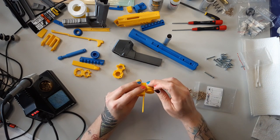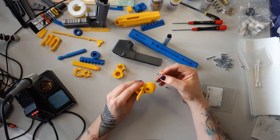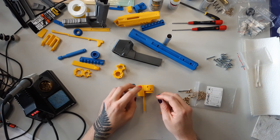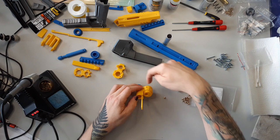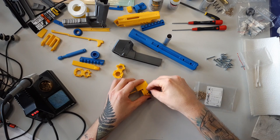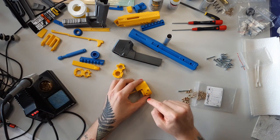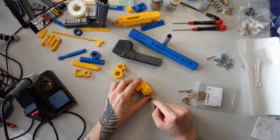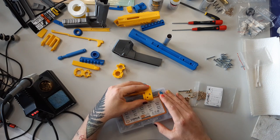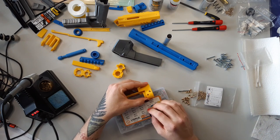So what you want here, you've got to know that these two screws are later on pointing, one this way and the other this way. So you need to make sure, when this part is laying flat like so, this is kind of on an angle. This comes from here and that comes from there. That makes it a little bit hard to push. So what you want to do is set this in here and lift this up a little bit, so this is a straight push. Then you put that in here. You want to do the same thing with this. Either you lift it like this, or you do what I like to do: get yourself some sort of edge and put it on the side right there. Then I'm just resting on here and I can push down that way.